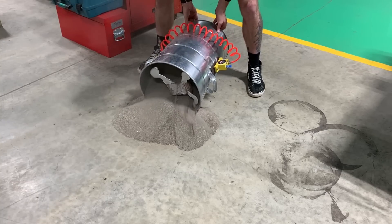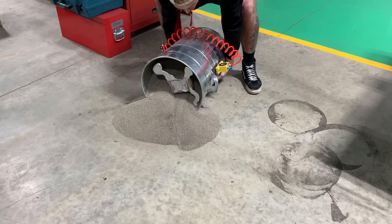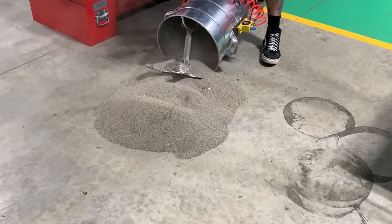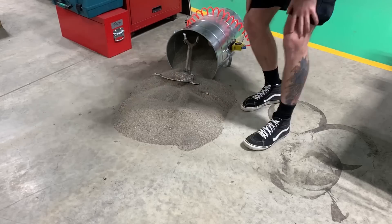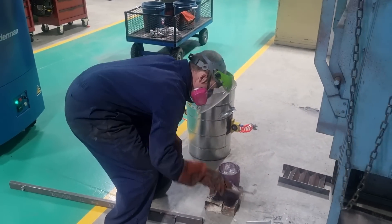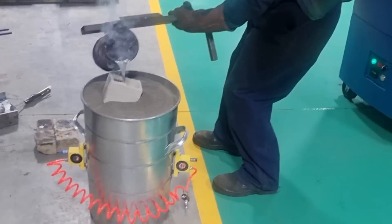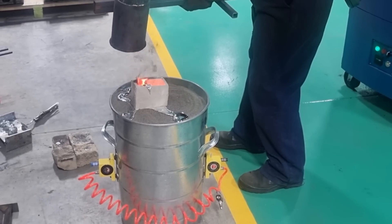It's a big chunk of aluminium at the top — I wonder if any actually went into the part. It's in open form, just pull it backwards. It's heavy — look at it, it stinks. Did it break off? The part's still in there, undamaged. So what happened here is a little bit obvious — during the pour I noticed I had a whole heap of aluminium left over and it stopped taking material pretty early on. I thought the material may have been a little bit cold before the pour, seeing as the crucible wasn't glowing orange. Being too eager and wanting to get this done without waiting too long, I poured anyway, which was a bit foolish.